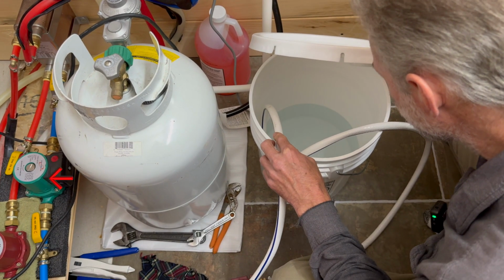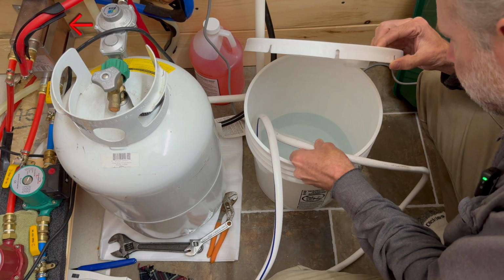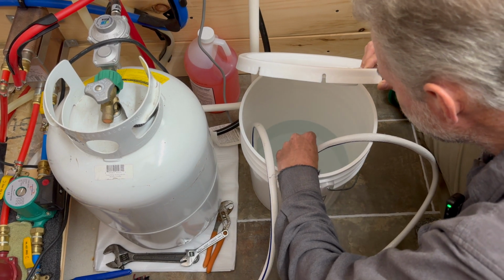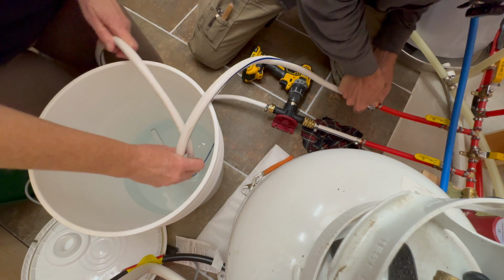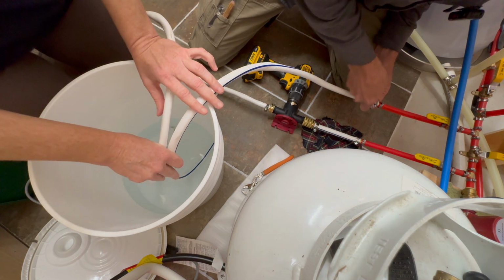That one will suck fluid through a copper pipe in the heat exchanger, so it picks up heat from another pipe full of hot water from the on-demand hot water heater. At least that's how the system will work when we're using propane instead of burning wood in the rocket mass heater.